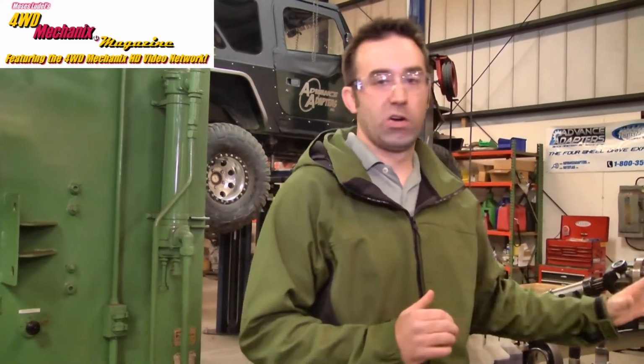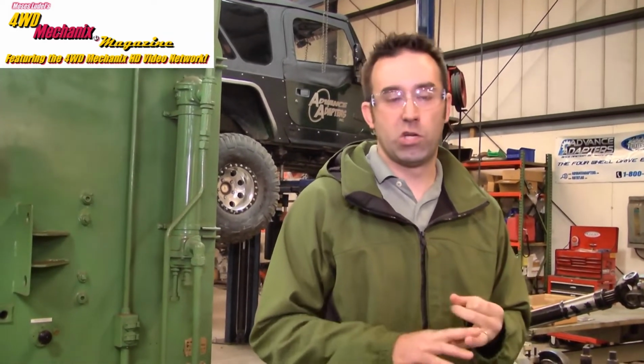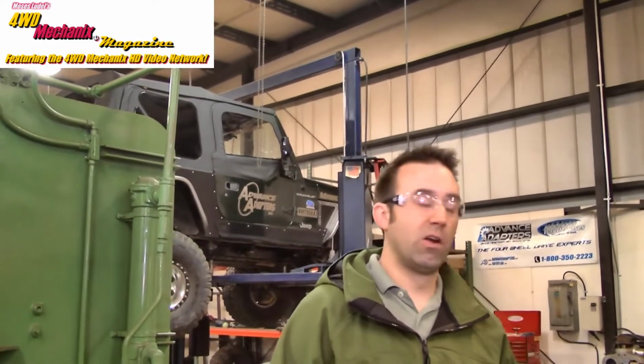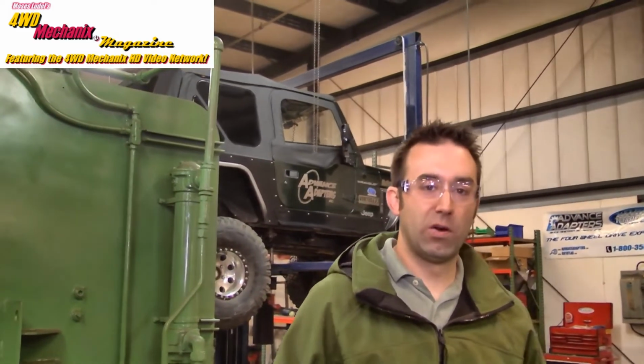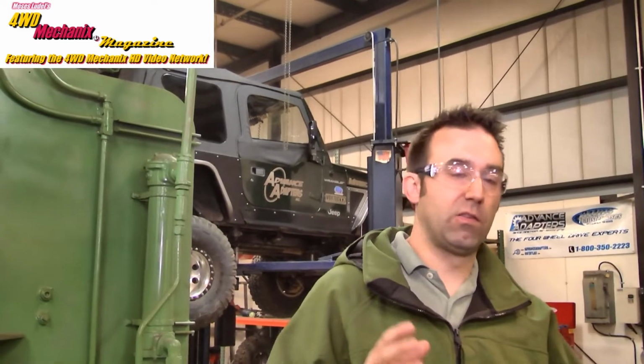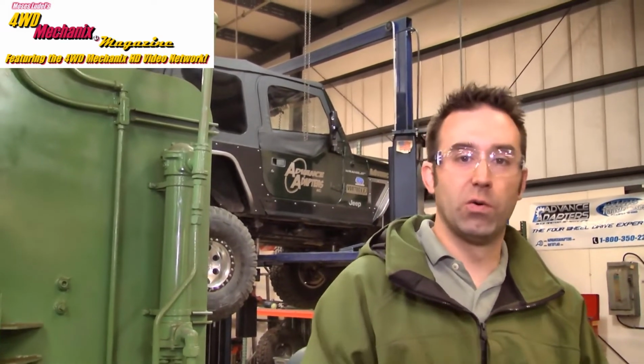We can monitor temperature, we can monitor noise, vibration, all the sources that might indicate a problem is happening right here in the shop. One of the unusual tests that we've run on this machine is oil fill capacity. You may have noticed in the Atlas transfer case manual that we specify 2 quarts for every single Atlas, regardless of gear ratio and rotation.